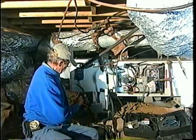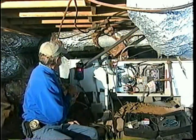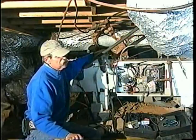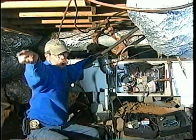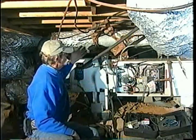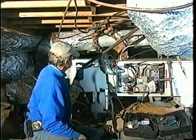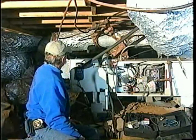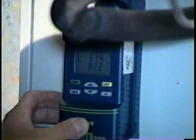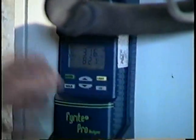The temperature is going up and it's beginning to steady out. Now it's down about 82% efficient. This is an 80 plus furnace. On a 90 plus it's PVC vented — I don't have to worry about a chimney, I can go through the block wall and bring combustion air in from outside. The pipe on that is cool, but this exhaust is hot and it'll get hotter. We're about at steady state — about 312 degrees — and we're running about 82% efficiency.